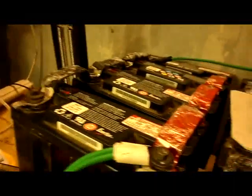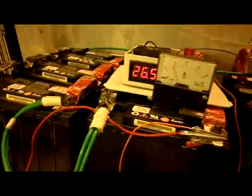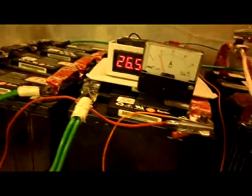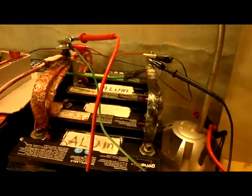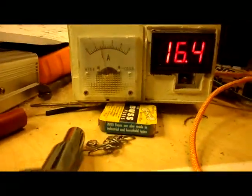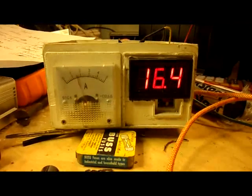Over here I have conventional wiring and I need to change those over — there are two packs I'll have to work more on. I did get the radiant side fixed. I still want to bring my tie points even to the batteries so that when I start really loading this, I'll have a more even distribution. This first battery had everything tied to it and was more charged up by a couple of points than the others. I'm only running about a 1 to 1.5 amp load instead of 1.6, because I kept getting too high on my booster adjusting for the inverter test.